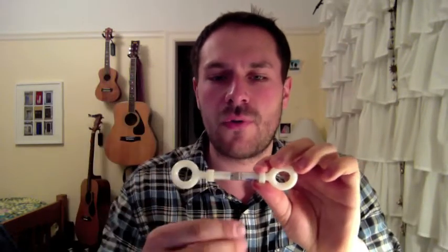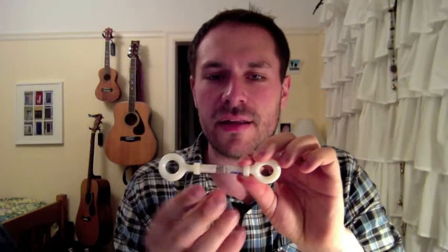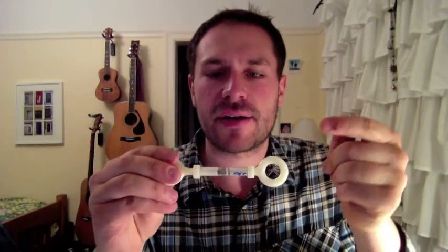The reason for this is that whenever you have a pressurized tube, the force in the axial direction that's trying to break it apart is always half the force that's trying to split it in the circumferential direction and sort of peel it open. So in order to get it to break axially and separate into two pieces, you need to reduce the thickness of the wall by at least half, so that the axial force — which is half the circumferential force — will create a higher stress than the circumferential stress and actually bust it in half.